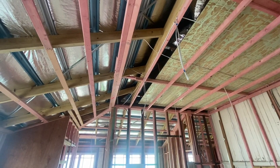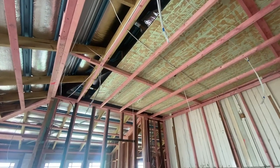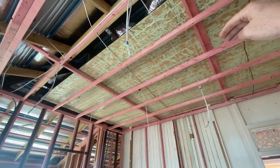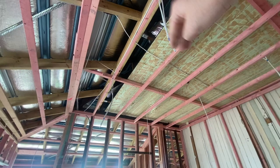So everyone, it's been about a week since that last part of the video, and what we've done is we've completed the electrical and AC works in the upstairs living area. So because we have the raked ceilings in the living area tying into the flat ceiling, what we've done is we've had to drop the ceiling in this high point here by about 60 mil so it ties in smoothly.